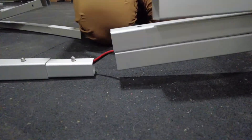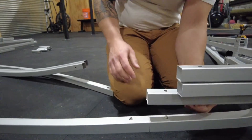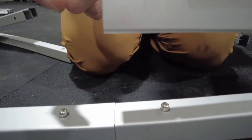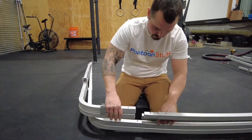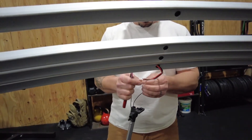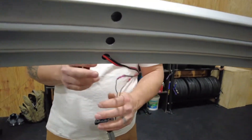We've got our wire pulled through the farthest-back tube, which is essentially our center bow connection point. That snaps together — when both spring buttons are pushed up through, we know we're connected. I'm going to continue assembling these tubes with the spring buttons and our bows and get the whole frame put together. We use heat shrink tubing so we get everything nice and waterproof. On an LED stern light, you'll have a red and a black wire that correspond to your power and ground — red being power, black being ground.